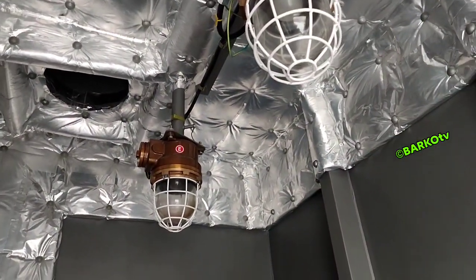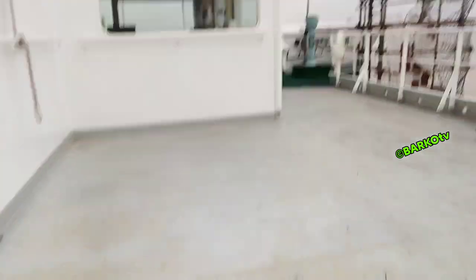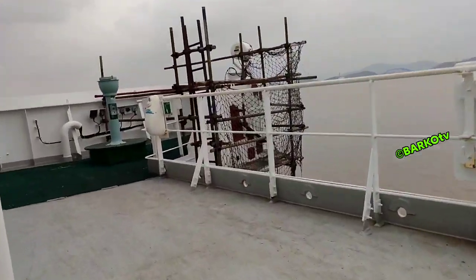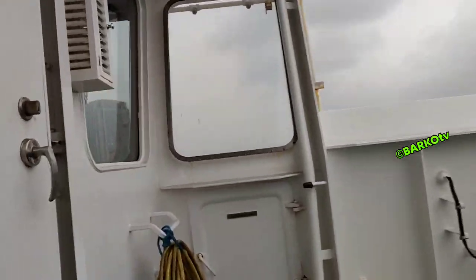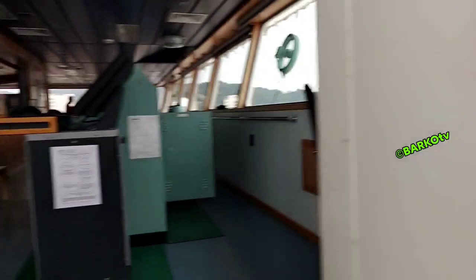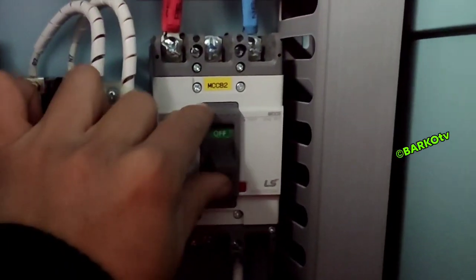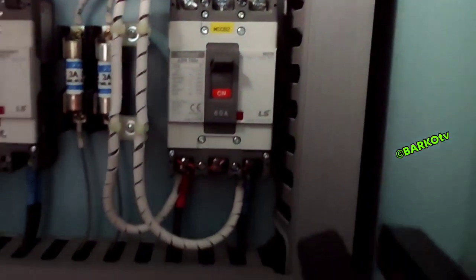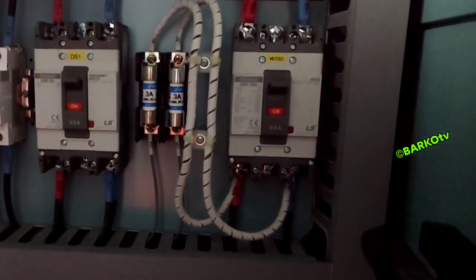In part two we will make a video about the GM — replacing batteries and also load test. Battery room check is good. All UPS and lightings are okay. Let's go back to the battery charger and we will turn on the battery breaker — the circuit breaker intended for the battery. That is the only breaker you turn off or isolate when you change batteries without interruption.